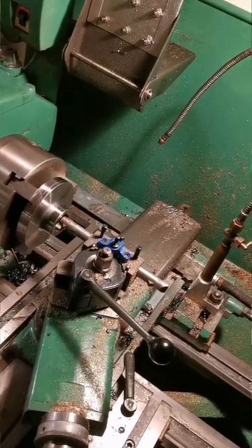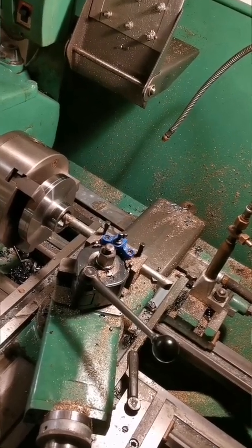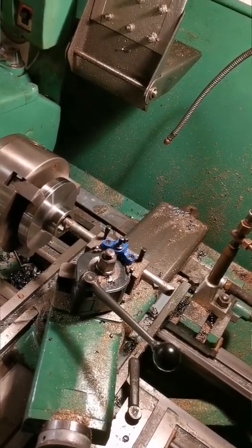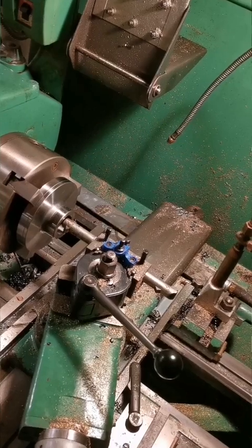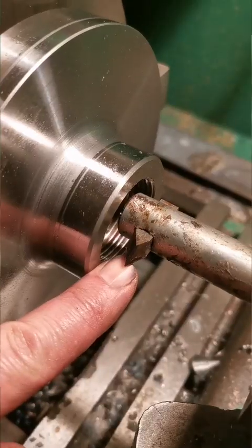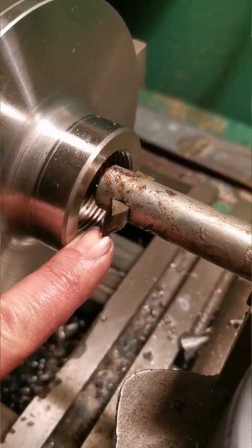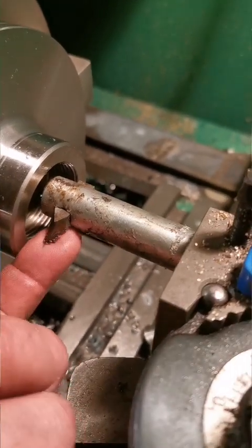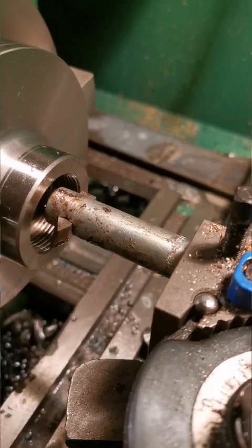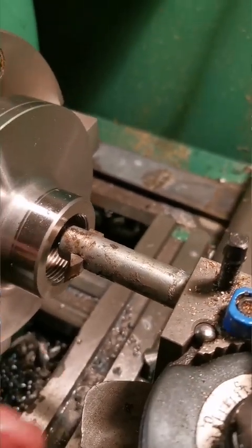There's many different approaches for screw cutting taper threads, but this is my preferred approach. Certainly not claiming glory for this. I was taught it by somebody ages ago, can't remember their name. I have the screw cutting tool upside down in a boring bar facing the operator. Being a right-handed thread, this clearly means that the chuck has to rotate in reverse.